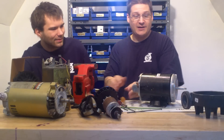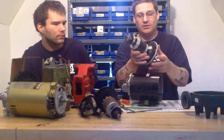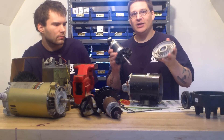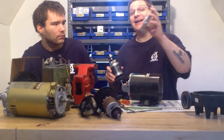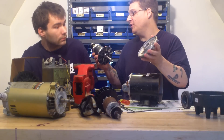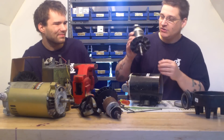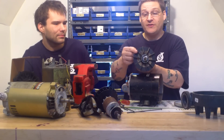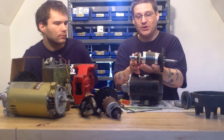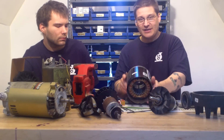Knock the front end bell off just like that, and once we do that you pull it out — see right there, there's your rear bearing. And then here's your front bearing. This is an EcoClear pump, it's kind of new, so things do come apart easy. The idea of this video is just to show you the parts and demonstrate it without dragging it on for 20 minutes. So here's your front bearing, here's your motor fan, here's your rear bearing, here's the switch — it's a triple switch. And inside here is your motor windings.